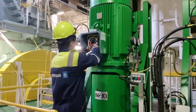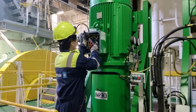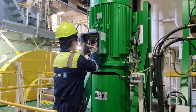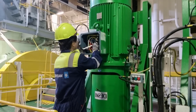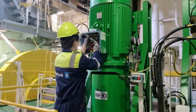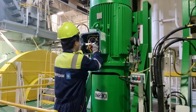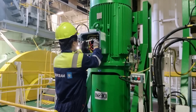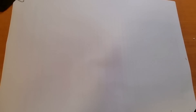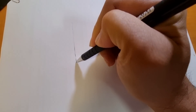After checking the insulation resistance line to ground, I now need to dismantle and remove the cables from the terminals and the plates. This is to isolate the condition of the cable and our electrical motor winding, so that when we test the winding condition we are measuring only the windings and not including the cable. For better understanding, this is the way it looks like inside.